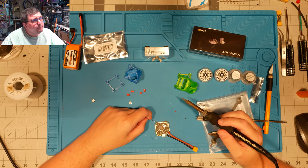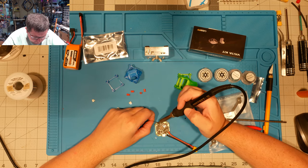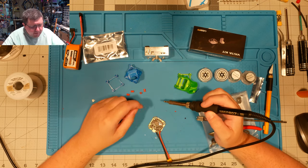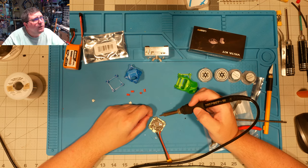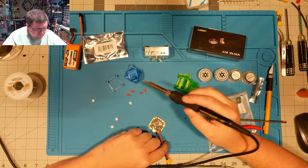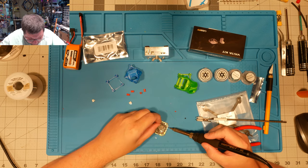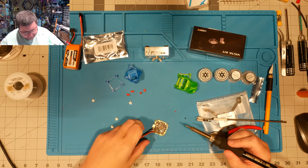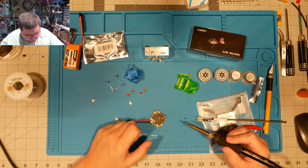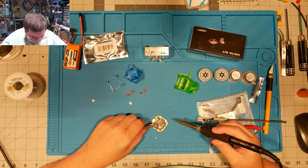We've got a ground pad, and we're actually going to need a ground pad, because whenever you run S-Bus or anything else, really, you should ground to the signal ground. And then there's a 4.5 volt, a 3.3 volt, and then an S-Bus line right here. That should be all we need to do for getting this guy up in the air, besides connecting two wires down here for our positive and negative to our Vista when we pull that guy out. Now we should go ahead and do up our motors.